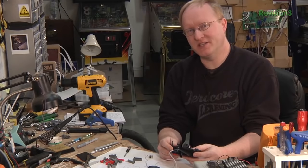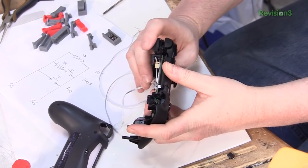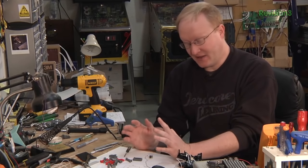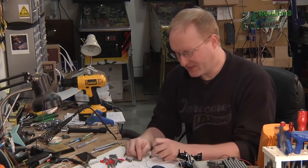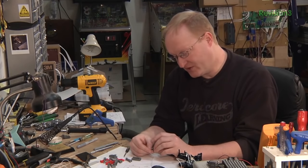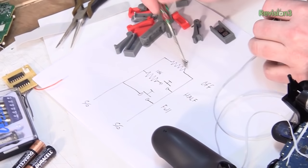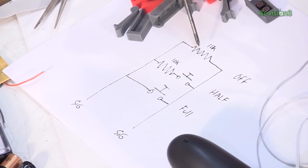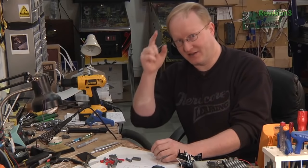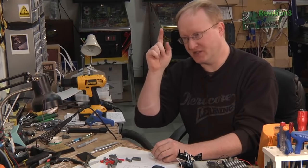The last thing to add to the PlayStation 4 accessibility controller is a secondary trigger. Obviously you can hit the R2 trigger, but you can't hit the L2 trigger, so we're going to put a trigger right here. Now it's an analog trigger, but we don't have a lot of room to make a mechanical analog switch, and we can't rewire the membrane switch we found inside. So I came up with a solution: we put switches in series and do a voltage division across it. We have our two signals going to the controller that always pass through a 10K resistor, giving about 10K nominal resistance. When you push the first switch, you decrease the resistance — which acts like the trigger is being pushed. When you push the second switch, it completely eliminates all resistance, which is like the trigger being fully pulled.